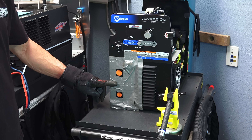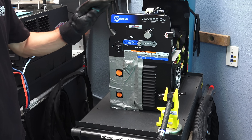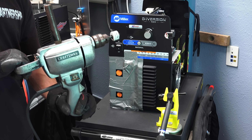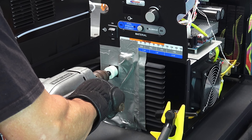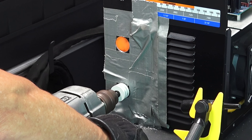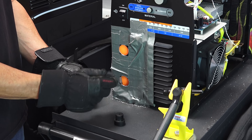We're ready to drill the holes in the face of the machine. This machine is on a cart so I've locked the wheels down and it's up against the wall so it won't slide back. Make sure the machine is in a solid position and get your drill. Got the hole saw installed and the drill bushing and ready to start drilling. The bushings did their job. The lower housing, the upper housing — these are the pieces that came out of the face of the machine. Got a nice clean cut.